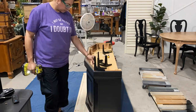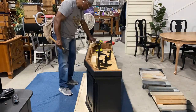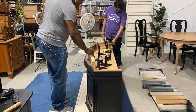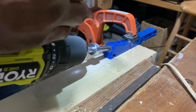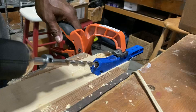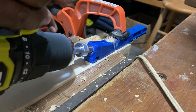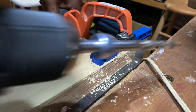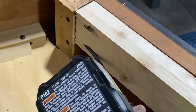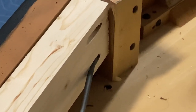I pre-drilled the holes for where the legs will go and then fitted the pieces onto it. We decided that we needed to add a little bit of additional support, so we're using our Kreg jig to pre-drill those pieces and then dry fitting them onto the bottom — that will be where the legs have that additional support that is needed.